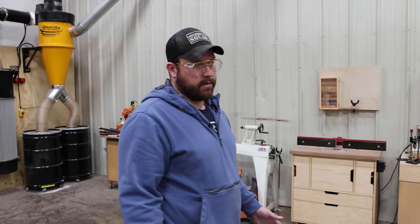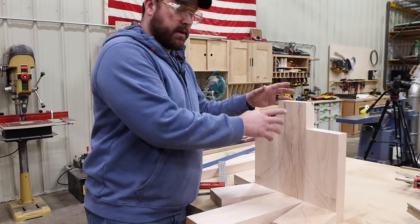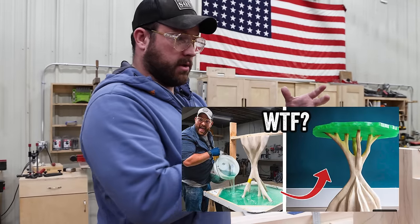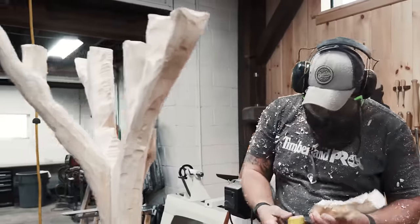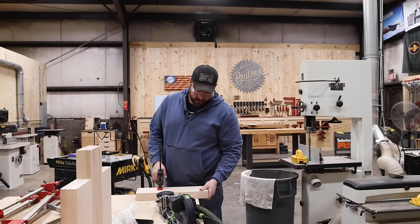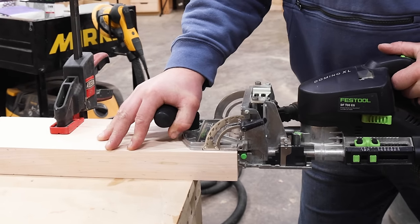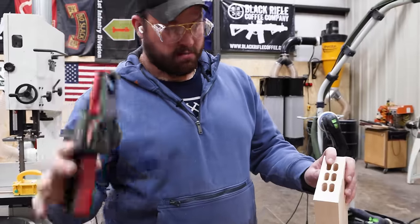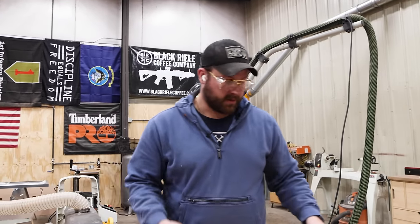That way I can get stabilization from the cantilever. My biggest concern is how I'm going to do the arms. I did a tree table before where I just started gluing things onto one another and letting them stand — it worked out but I snapped a bunch of pieces off. For simplicity's sake I'm going to use dominoes at least for this part. I think it'll keep it pretty easy. I'm going slow, trying to do as much work as I can while the wood is still square. Six dominoes is a good place to start.